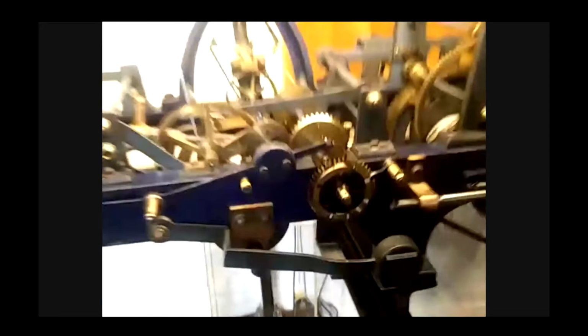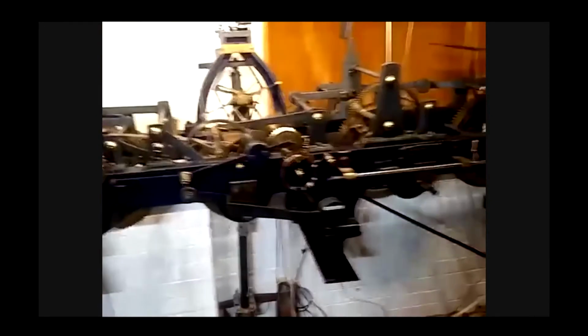So that is where the time goes out the wall and to the real world. And where it connects to the clock, well, we can follow that from the real world over to this lovely bevel gear. And that bevel gear takes us back up into the clock, where it connects to the minute hand. Right, that's the important bit. The bit that ticks tells us the time.